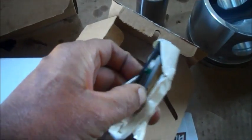I got this little box here — these are your rings. There are three rings all wrapped up. Hopefully I can figure out which one goes where. I know the oil one goes on the bottom but the other two I'll figure out. The other kit was all wrapped in plastic and it showed what position they go in.